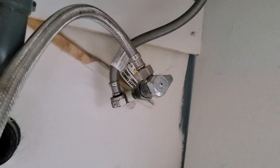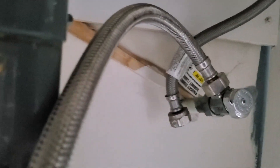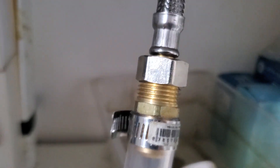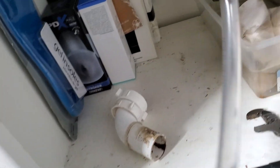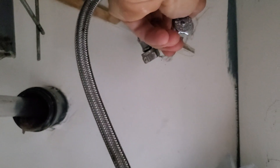I got my tester. I usually put it on the hot, but there's a bunch of stuff here, so I take off the hose for the faucet and put on my own supply hose — it connects right here. Then I take this, stick it in the drain, and make sure you're positioned right there in case it backflows. Then you just turn it on nice and slow.